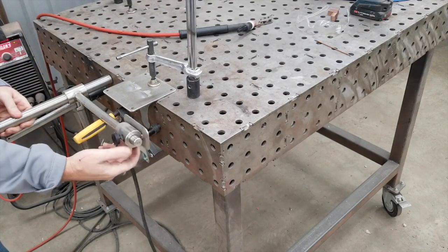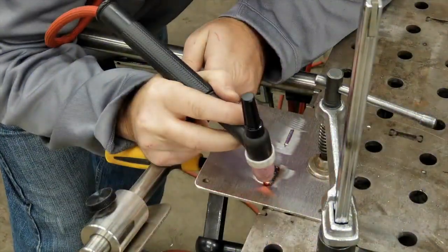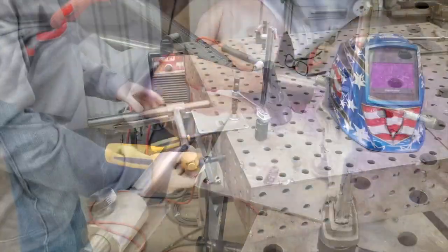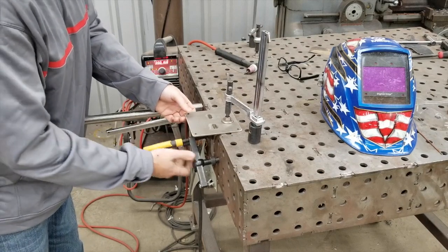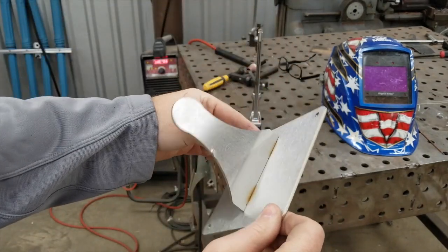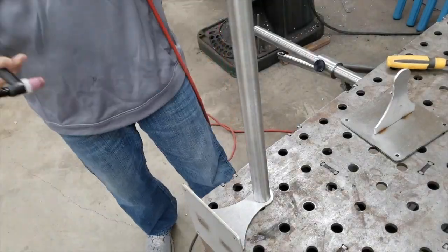I'm a little worried it might not be a strong enough weld back there — I was trying not to put a lot of heat into it. Here you see the prop rod that Reid Aichner made me, always on my table. I was filling this in on the back with a pulse weld at about 170 amps, wanted to weld it fairly hot but also didn't want a big weld on the back that I'd have to grind down. It wasn't hot overall to the touch so no overheating issues. Here's the Guru Machine Works clamp and square — got it squared up pretty nice.